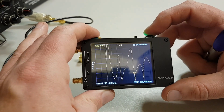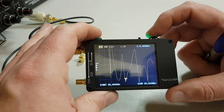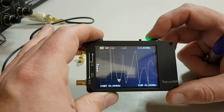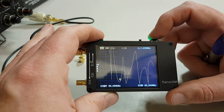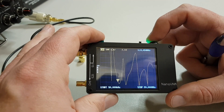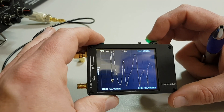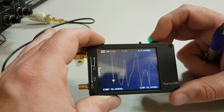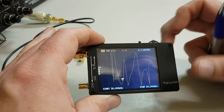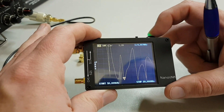The antenna I'm connected to at the moment is the very first fan dipole I ever made. Looking at the SWR readings, they aren't exactly perfect. For 40 meters it's showing about 1.7 to 1.9, which is pretty good, but the shocking part is the 80 meters — even at its lowest point it's still showing 2.2 SWR. That's a known antenna I have problems with — something I'll be fixing in the future — but this just shows the versatility of the actual graph.